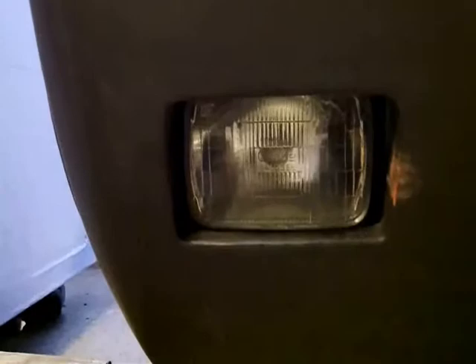Here's number one on the right side if you're sitting on the bike. Here's number two. Let me go inside — I'm going to get off the ground. There's the two bolts, here's our new bracket. What I like too is when you tighten these down, it kind of pushes it into the hole — pretty cool. The top of the glass just rides the edge, that's how I set it up. There's the other one. Now I just got to pick them up, patch the holes. The glass rides across the bottom nice, it's not crooked or nothing. Clamped in good. A little offset, not too bad — I've got a little bit more of a gap on the inside, and a little bit more of a gap on the outside. Not a big deal.